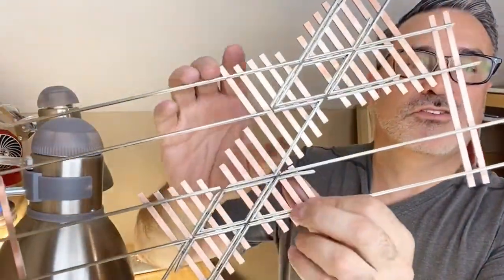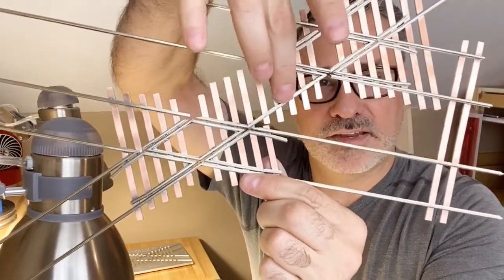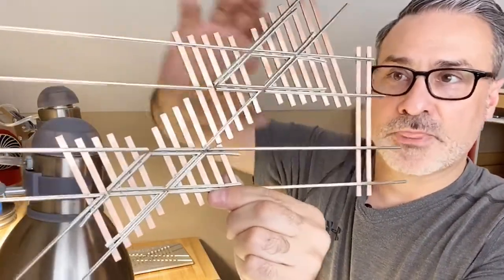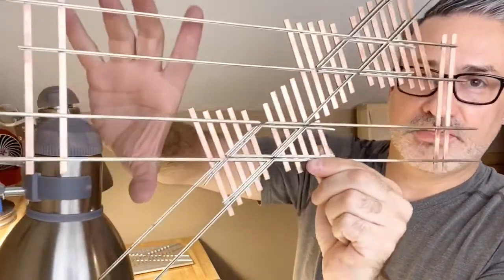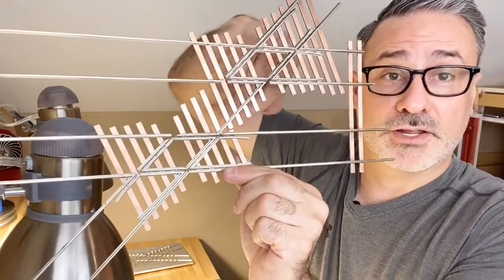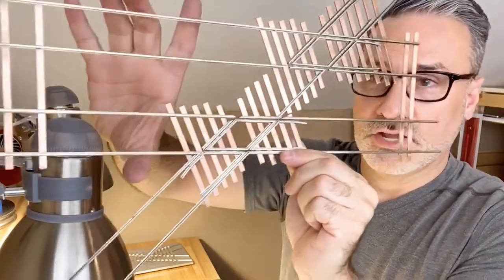I've got some gloves here that I'll put on right before we start soldering. I'm going to solder this live and not in the fixture. What I approached this crossing with is: I built parts of it in the fixture. I left this off completely — I did put one rail in last night, but basically there were two separate crossings that I had to join together somehow. This is my parallel track right here, so these two rails needed to be perfectly parallel. This piece is just a dummy crossing — I'm never going to run any trains on it, it's going on an 18 inch module.